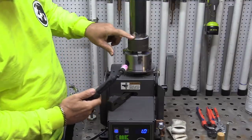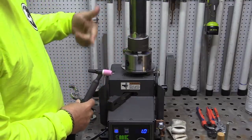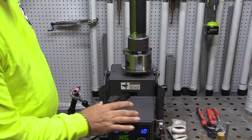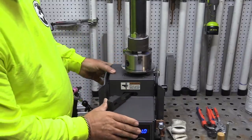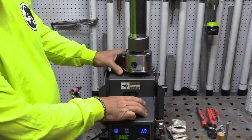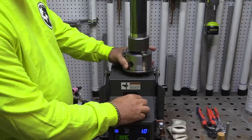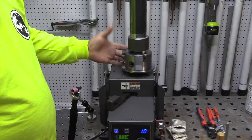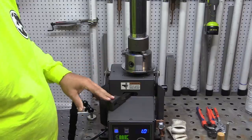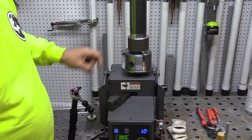One of the coolest features is if you duff your electrode or need to stop for something, you don't have to wait for the part to come all the way back around to where you restart. It's got a neutral clutch. All I have to do is kick it out of gear, spin the part around to exactly where I want it without undoing the chuck, put it back in gear, and I'm ready to go again. It's a big time saver for positioning without having to take the part off or wait for a full revolution.